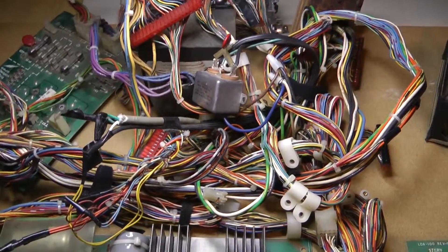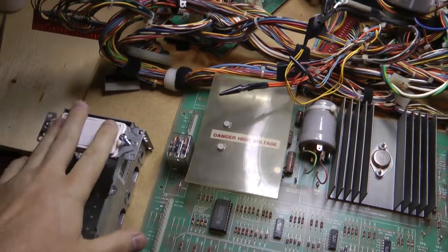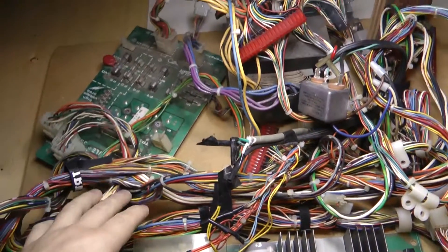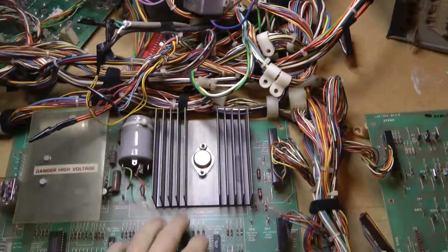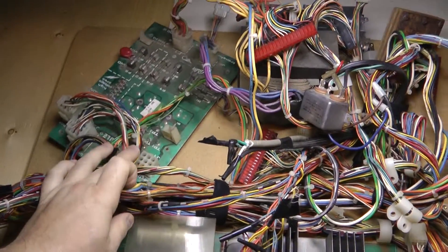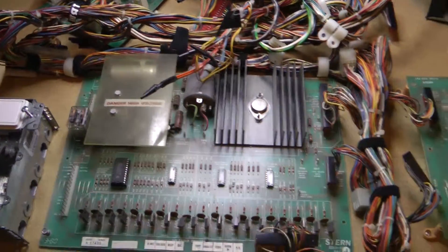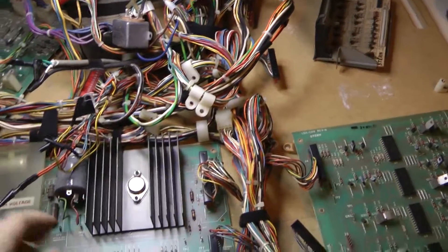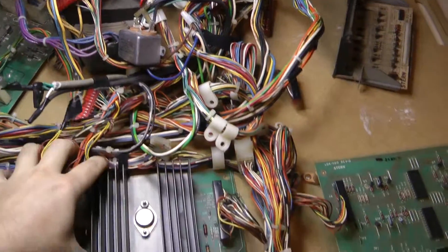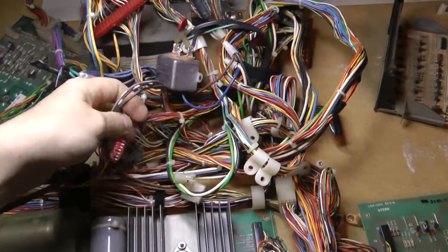I'll put an MPU right there. I was using this as a crude test rig but I think I'd just like to put it together a little neater. I had intended to put some switches — I was going to switch the high voltage, I'll still do that, and I might switch some of the other voltages. What I'm not going to do is incorporate a soundboard or the displays into this main piece. I'll just leave the harness neatly velcroed, and when I need to test the displays I can just pull that harness out. I'll probably eventually build in connectors for all of the soundboards and rebuild all of the connectors. I'll rebuild and bulletproof the boards — basically have a nice working test bench with good boards and connectors where I can test boards and develop new hardware.